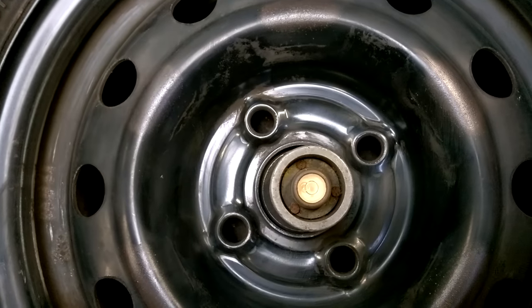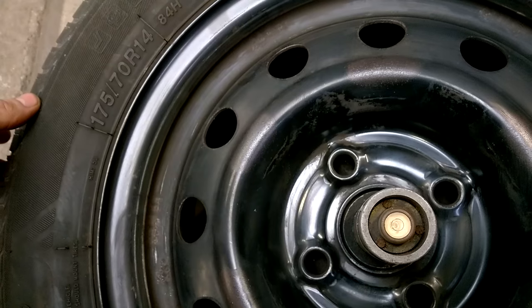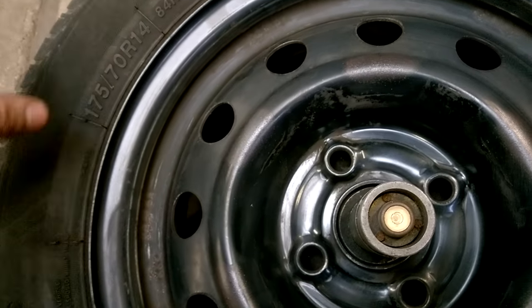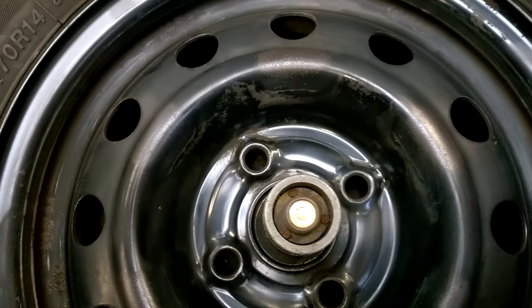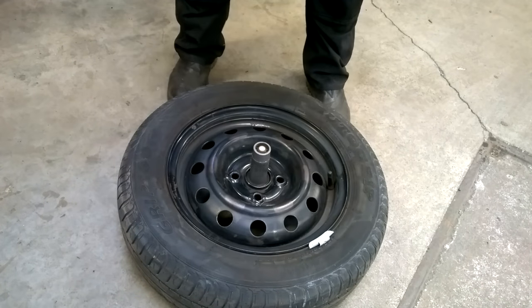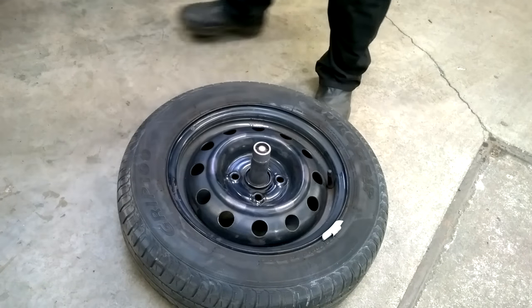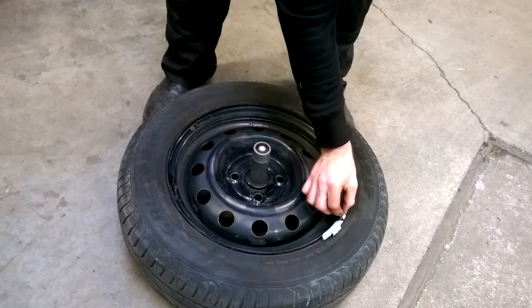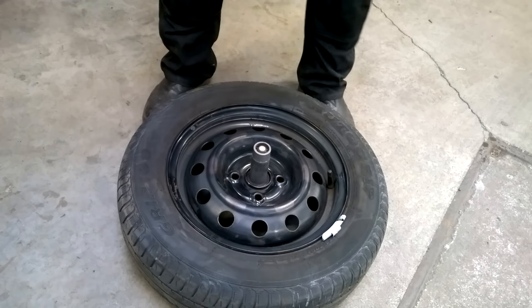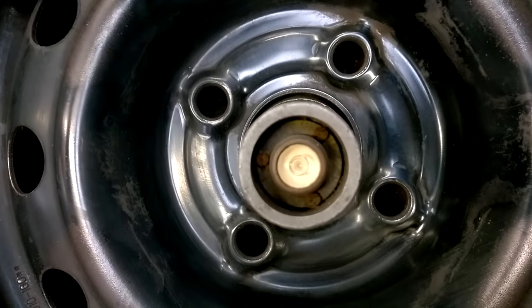You can see that it is out — I will need to put an adjustment. There needs to be weight on this side, so we'll start to put weight on this side to get that bubble into the center. It has taken 45 grams of weight to get it right dead in the center.